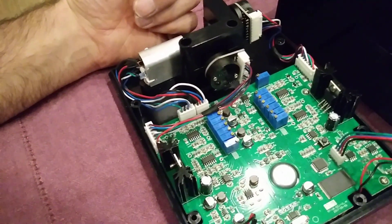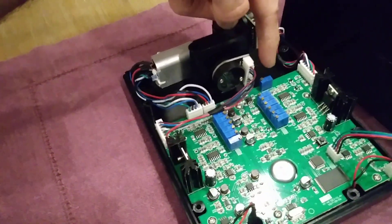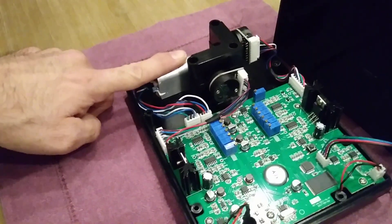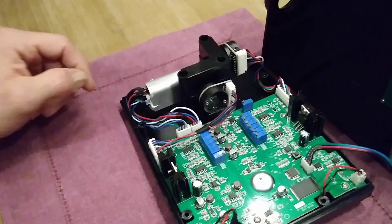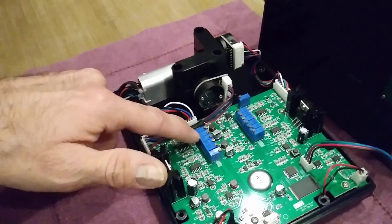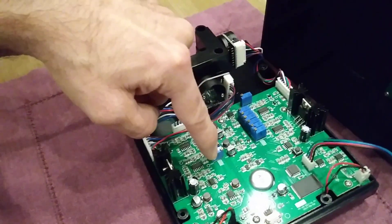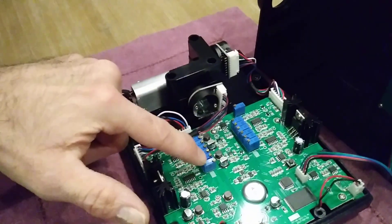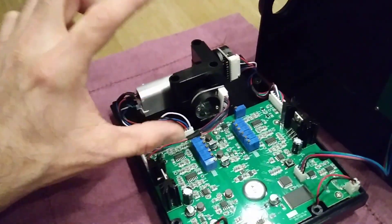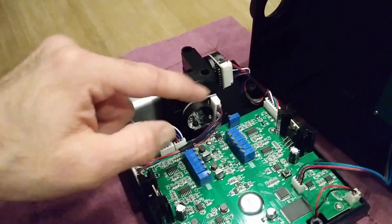You need some permit for that kind of laser, which I have already because I've worked in that domain. So this one is actually set for 5 milliwatt maximum, but I will show you how to hack it because you can pump that laser pretty high compared to what is already set from the manufacturer. Also, those potentiometers here — let me describe how they work. I think some are for high-frequency filtering, low-frequency filtering, some gains, but I discovered that one is for the size of the X axis and one is for the size of the Y axis, so you can play with the size of the image using those two potentiometers.